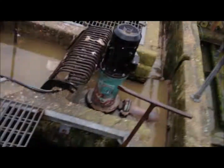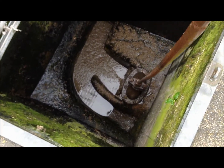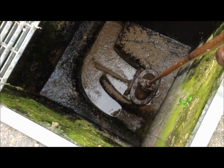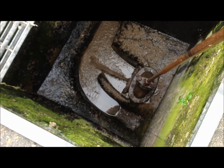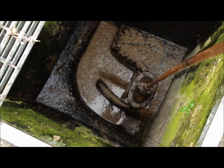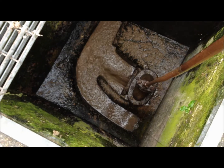First thing I always do is open the valve very slowly, just to trickle the water out of the pipe until you get to the sludge blanket. As you can see, I've already opened this up a couple of minutes ago and it's coming through quite sludgy, so continue to open the valve slowly and allow the sludge to come out and pump up to the sludge holding tank.